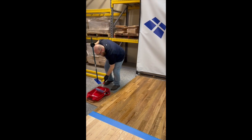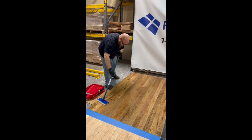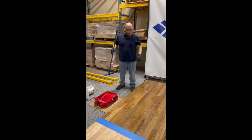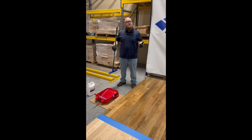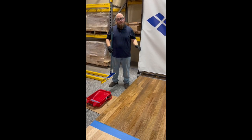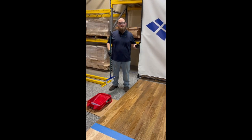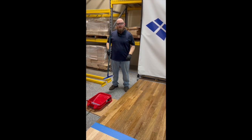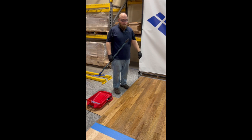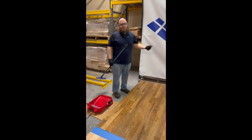After working that in, smooth it out just a little bit more. Now we're going to let this dry for about 10 to 15 minutes. What we're looking for is it to be either a brown with no shiny parts on the surface — meaning no standing puddles — or it will actually fade a little bit to a gray. What we don't want is to let this product dry for too long, because we need a reaction with part two to happen while it's still damp. If we let it dry too much, we have to come back in with more of step one and re-wet the floor. We don't want to put a fan on it or try to accelerate the drying — let it happen naturally, and then we'll take the Red Out.